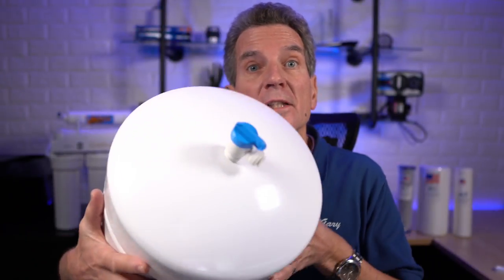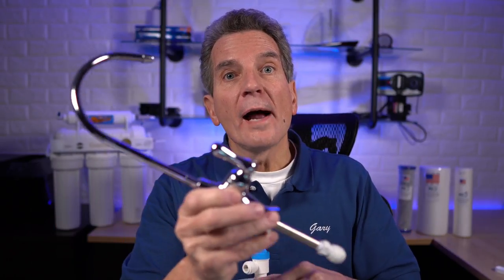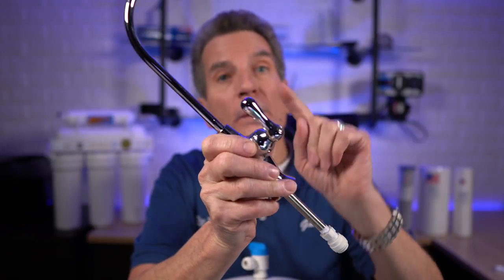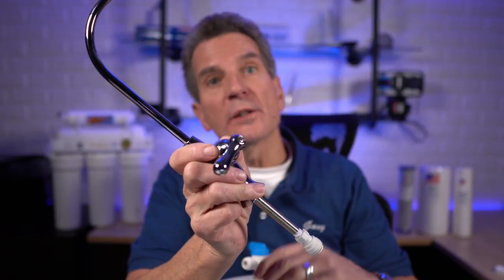Then you're going to turn off the tank. At the top of the tank there'll be a shutoff valve — turn it 90 degrees to turn off the flow from the tank. Some brands of reverse osmosis systems don't have a shutoff on the tank; if they don't, you'll drain all the water from the whole system including what's inside the tank when you open the faucet. I prefer to shut off the tank so you can use that water already in your tank to flush the new filters. After shutting off the supply and the tank, open the faucet to release the pressure throughout the whole system.